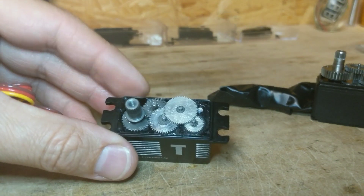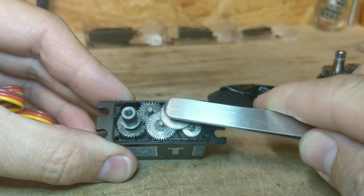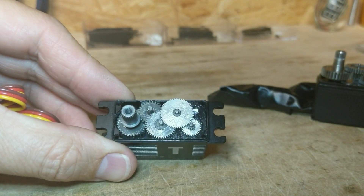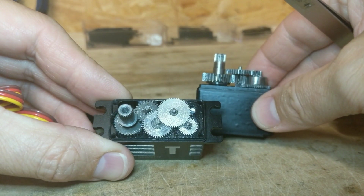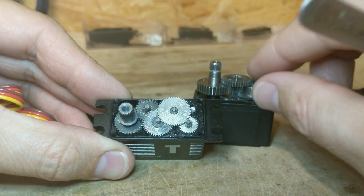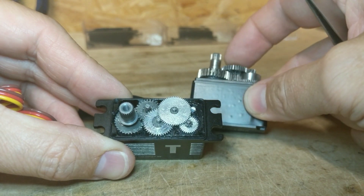So now we have the Model T. You can see that every gear is on its own pin, and that reduces that really long pin that you have in the center here. That actually removes the deflection altogether that you'd get, which leads to broken gears or broken pins.